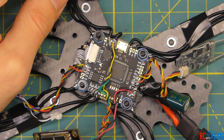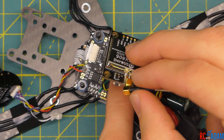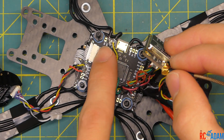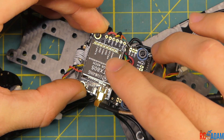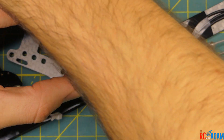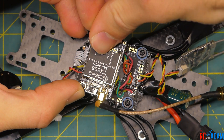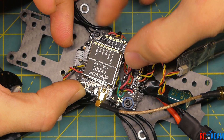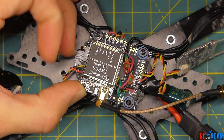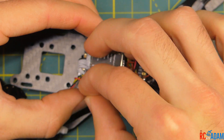I think this is going to work out pretty well. We're going to take our video transmitter here and I'm not going to put the wires directly under it but kind of in front of it, because I want to make sure there's a gap underneath. Then we're going to take these nuts and thread them onto these standoffs to tighten down the video transmitter.